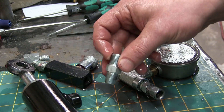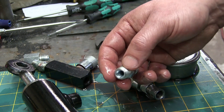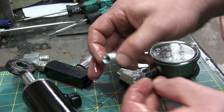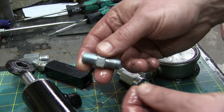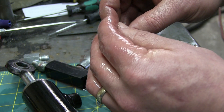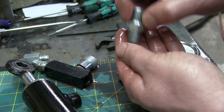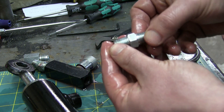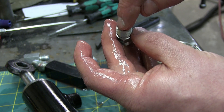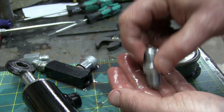I explored this through my Arduino hydraulic pump project. Any kind of pump, especially a reciprocating pump, needs to have check valves — otherwise you can't build any pressure. Here's just a fitting, and you'll note there's a nice chamfer on the inside of that fitting. You get yourself a ball out of a ball bearing that fits in there. If you put oil in this way, it unseats the ball — this is called a check ball — and oil flows. If it wants to flow back, it forces the ball into that chamfer and seals it up tight. Very effective check ball.